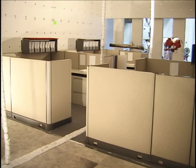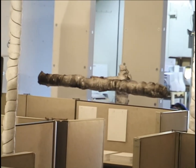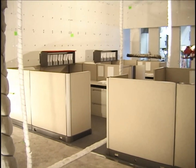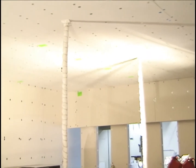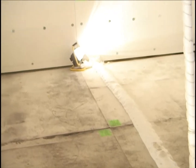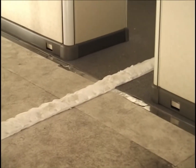Looking toward cubicle 1, the distance with spray burner above the wall of cubicle 1. Cubicle 1 and cubicle 2 are set up identically. See the thermocouple trees here, those two locations and the third tree to the east of the cubicle arrangement. See the lead wires going out and being fully insulated all the way out of the compartment. All the thermocouples in the compartment are treated that way.